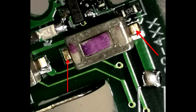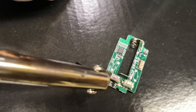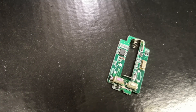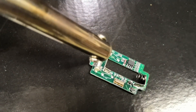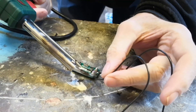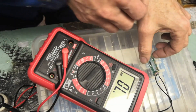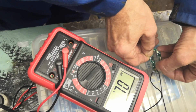I'm going to start off with a bit of a bodge — I'm going to try and enlarge the size of those solder terminals before I get a wire on there. Fortunately, the chips are at the other end of the board. My soldering ain't great, but no need to comment — if you want to send in an actual video of you doing it with this actual remote control, add that to the comments. I'm putting those wires on now, and later I'm going to add two more wires onto the battery terminals to get the supply in. Connecting those two wires to the multimeter to make sure the switch is still good — press it down, and yep, we've got continuity. Excellent.